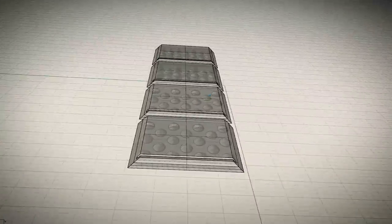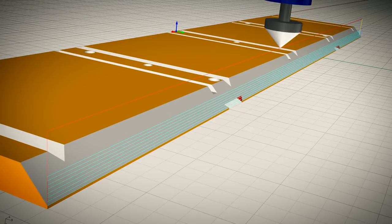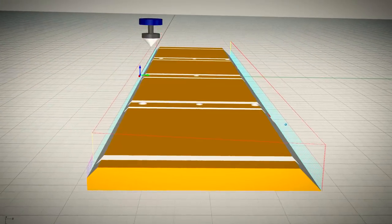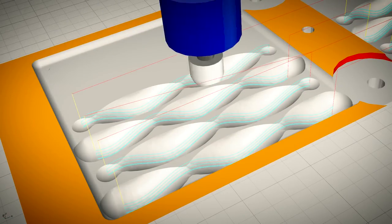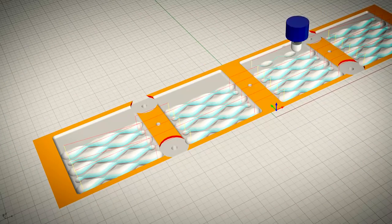I'm cutting all four sides of this box at the same time. The machine operations for the back side include 45-degree miters, the dados for the bottom of the box, and a chamfer for the inside of the top edge. I used those roller coaster B-splines to guide a half-inch round router bit through multiple depth cuts on the front side.